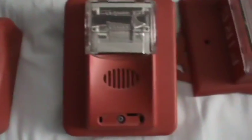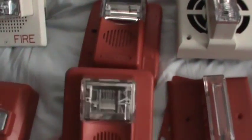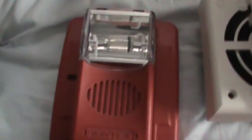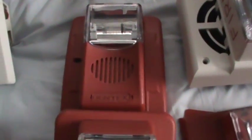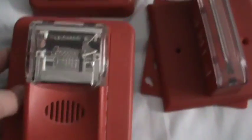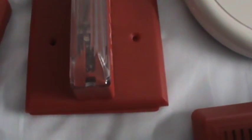Another one that I like is the Gentex Commanders. There's Commander 3 and Commander 1 — these are both four-wire. The Commander 3 and Commander 1 sound different. There's also a Commander 2 and Commander 4. The Commander 2 is like the Commander 3, only it does not have a brightness — candela — selection on the strobe. The Commander 4 is round and it's a ceiling mount version of the Commander 3. For remote strobes from Gentex, the GXS is quite common; this is an older model and not very bright, but if you can find the newer one with a reflector, that would be good. Other older Gentex models like the GOS, SHG, and GMS are good — they are all four-wire, so they're pretty easy to use. This GOS is multi-tone.